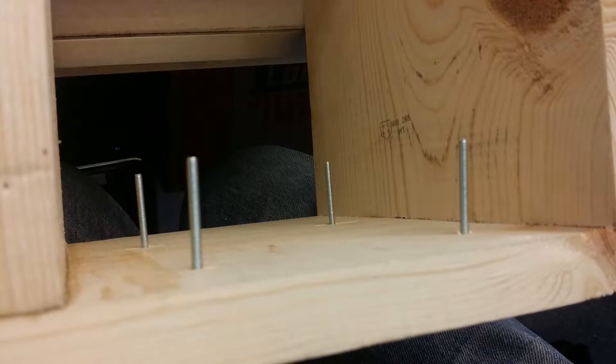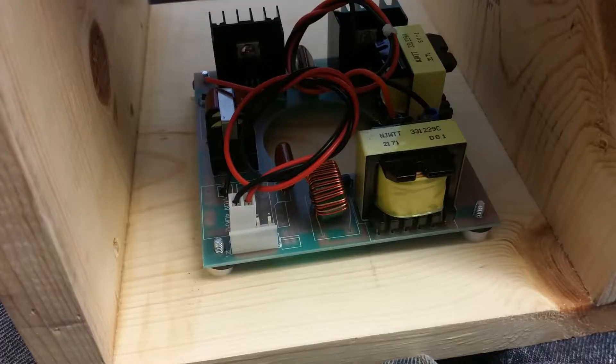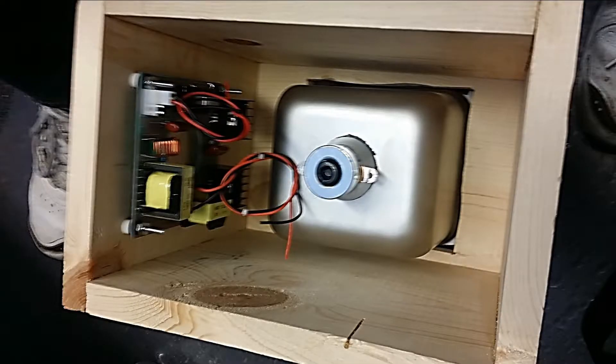This is a shot where you see the screws coming up that will hold the control board. I backed them off a bit and then added the spacers and the first rubber washers. This may be overkill, but in case there were vibrations happening in the wood I wanted to make sure that would not transfer over to the control board. So I set the control board onto the screws. I have the wood, then a spacer, one rubber washer below and another rubber washer above — just trying to isolate that board a little bit. Then two washers on the screw, secured with blue Loctite threadlocker. I believe that will hold that board just fine for a long time.